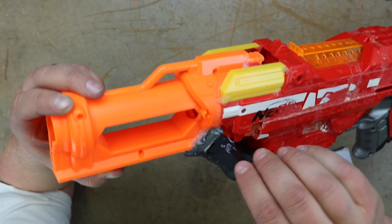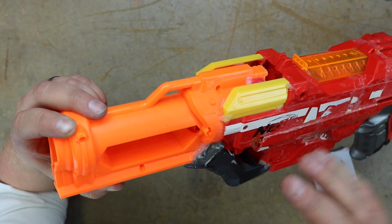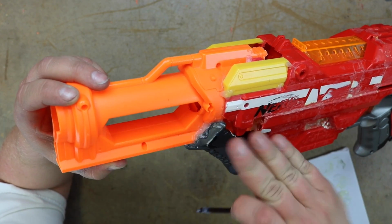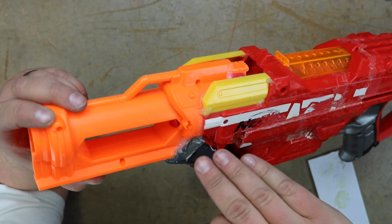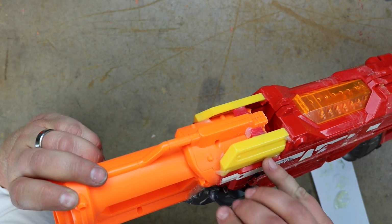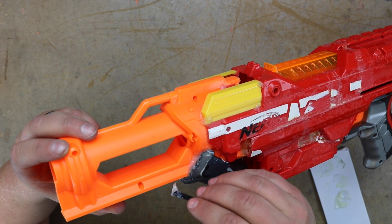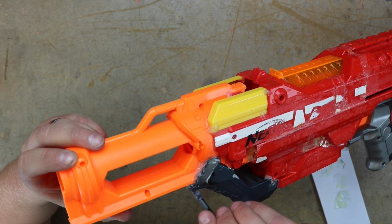I'm trying to build up this hole, or fill the hole here, but I'm trying to not just gorp a whole bunch on there. I'm trying to make enough to be sure to fill, but making sure I don't come at too much of an angle. I'm wanting to have kind of a flat face there, because you have flat here, then an angle here, I want to have kind of flat going this way. So I'm wanting to maintain as close to that angle as possible, so it'll involve less sanding later. And right now for this first coat, or layer, so to speak, I just want to make sure I get enough to bridge the hole. I'm not trying to get it up to where I want it for keeps, for finish amount. Just enough to get the basic in there.